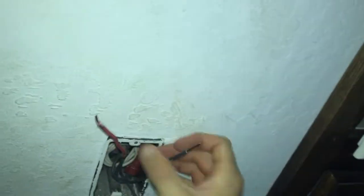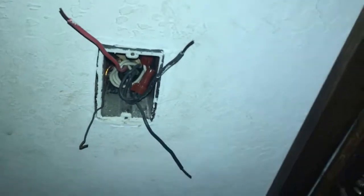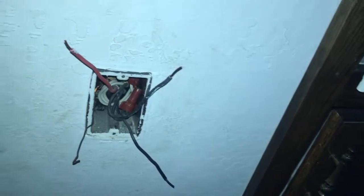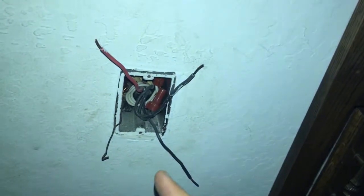After you've used your wire cutter and the appropriate gauge to strip the black and red wires, put them out like this — try to keep them from touching each other, spread them as far apart as possible to avoid shorting any circuits and potentially creating a fire. Do the same thing at the other side of the hall. Now double check that none of these wires are touching each other.